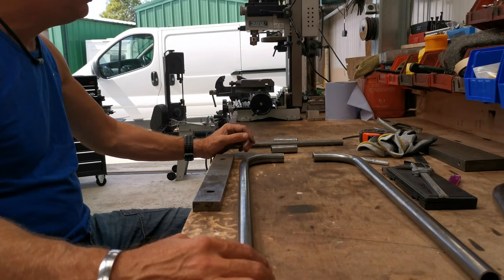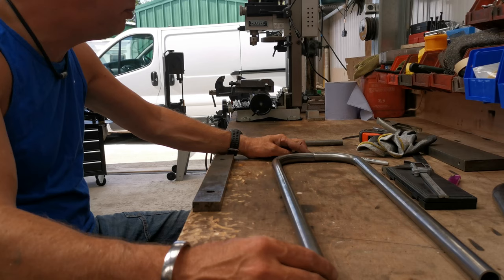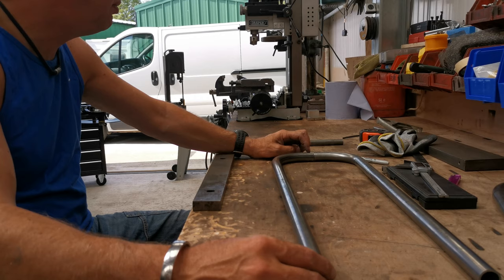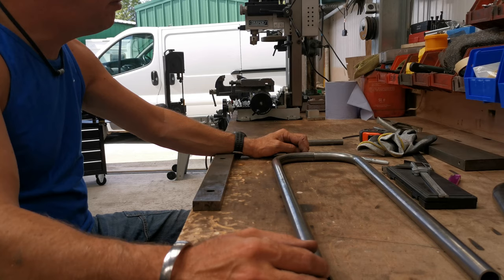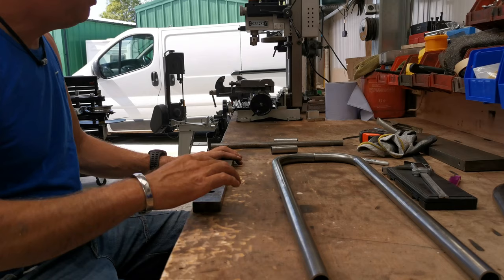The reason for having the flat on it is this is where he's talking about putting his tail light. So we'll set that into the back end of this hoop. But coming off the back of this, we can also make provision for a license plate holder, stuff like that. So rather than welding anything to a curved piece of metal, it'll be to a straight piece of metal. Should neaten it up no end. None of this is straight yet. It all needs to be sorted, but you get the basic idea.